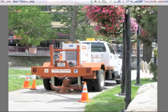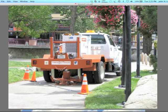Now, I'm going to play some animations which will show you how these vibrators look when they're in action. You'll see first a much larger vibrator, like the one they used on the geothermal project. Then you'll see the reaction mass of this one in action, and you can see it moving at the lower frequencies of the sweep, as it's called. And then you'll see how we here in the class, since we can't afford to spend $50,000 or $100,000 to mobilize these vibrator machines from other parts of the country, from Texas particularly, have to put in our seismic sources using sledgehammers. Okay, so we're going to go off to that animation now.